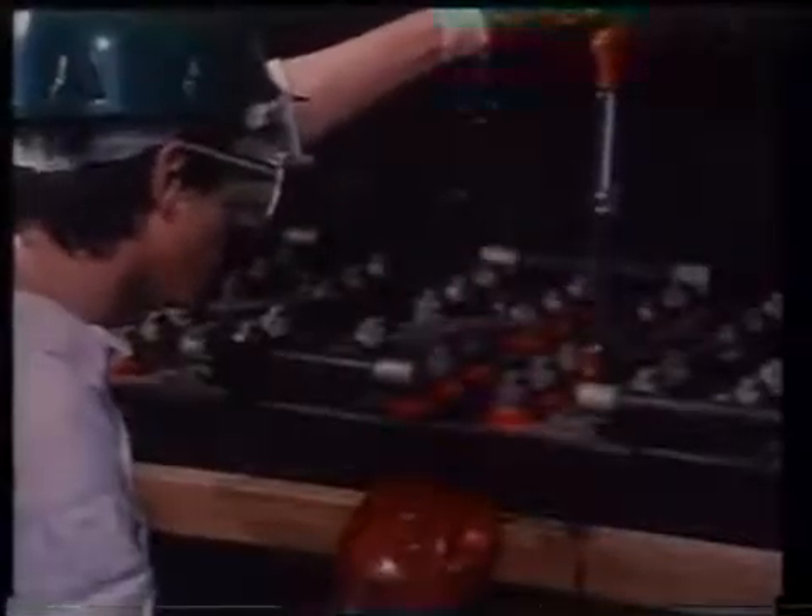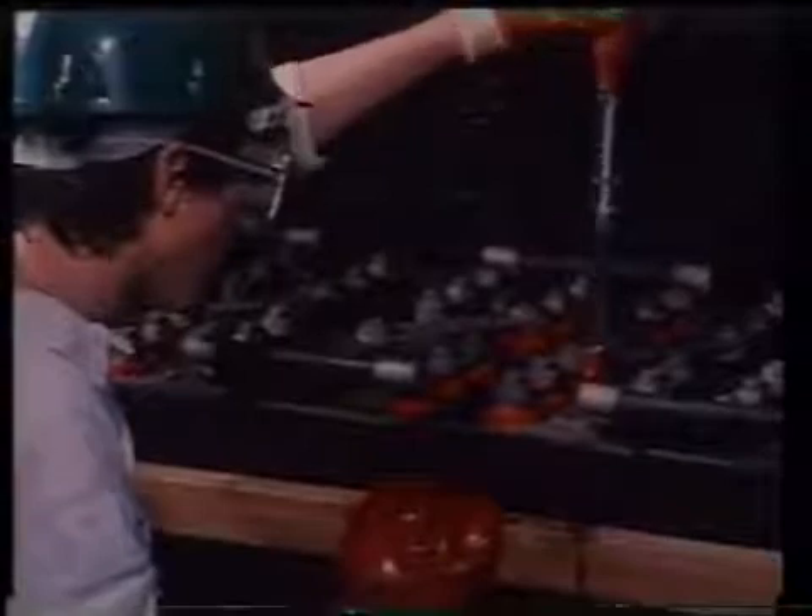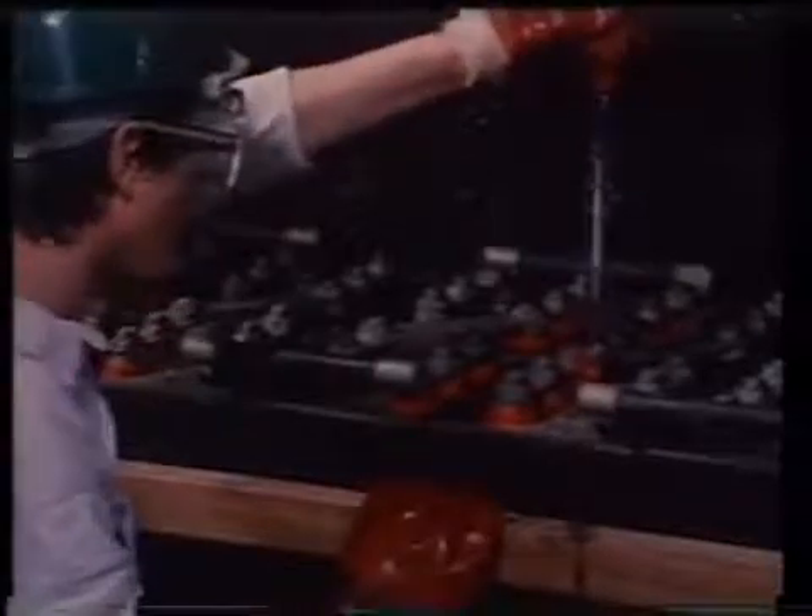Check the emergency battery condition and ensure that the charger functions efficiently. The battery tops must be clean with no corrosion of the terminals and connections. The battery electrolyte should be at its correct level and have the proper value of specific gravity, checked by a hydrometer.